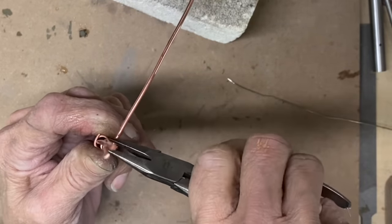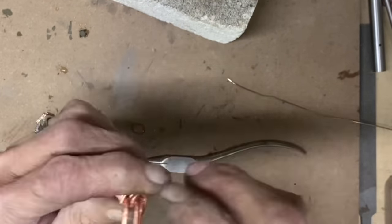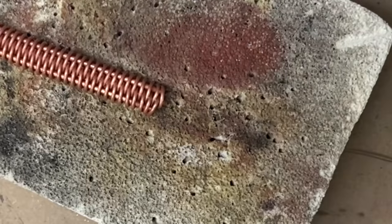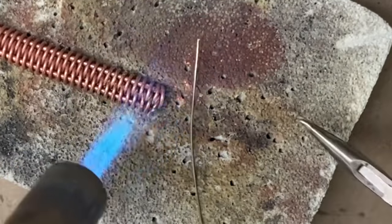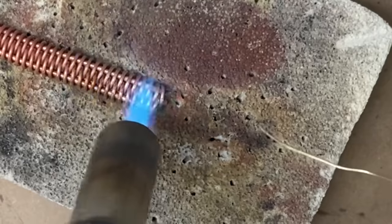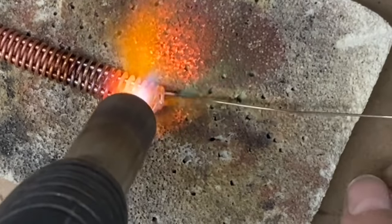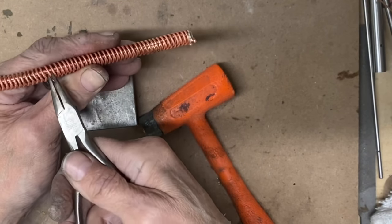On the opposite end, once I have those coils as tight as I can get them, I am going to bend the 12 gauge wires down and nip them off right above the bend. That is going to make everything really nice and tight and as compressed as possible. Then stick soldering the opposite end again with hard solder using the butane torch, feeding in enough to get the 12 gauge wires soldered to the 16 gauge coils.